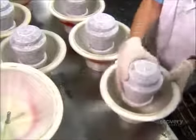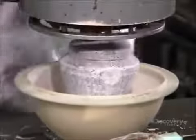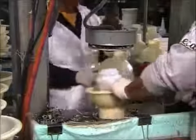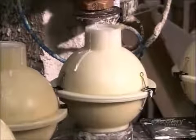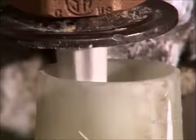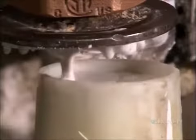This asymmetrical core is about to be encased in a more uniform sphere. They tamp the core into the bottom part of the mold and then lock down the top half. After all, they don't want any leaks as they pump it full of plastic. It's a liquid polymer blend. A special chemical in it causes the mix to solidify slowly. It can take days for it to harden around the core, depending on the formulation and type of bowling ball being made.